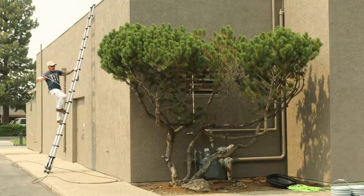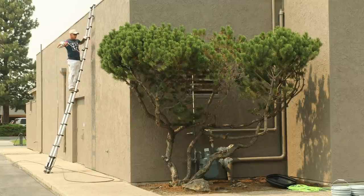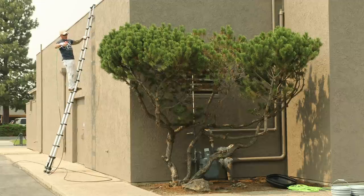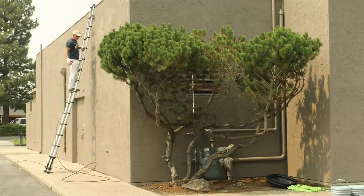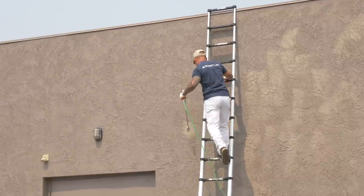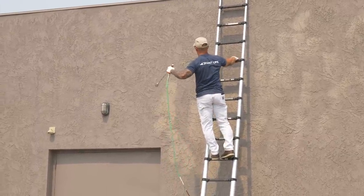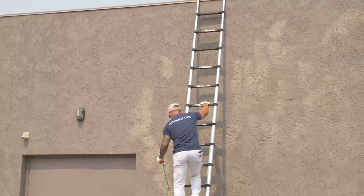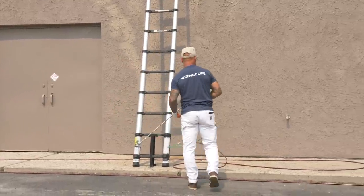As I'm climbing up here, now that it's dry, I can see light spots. When the stucco is wet, you can't see these light spots, which are white because the previous color was white. One of the benefits to doing a flat on stucco is you won't see any type of flashing or sheen difference, because you're flat on flat, and flat paint is very forgiving on stucco.